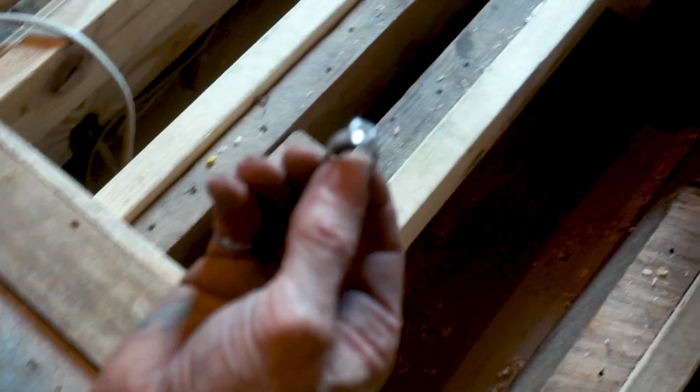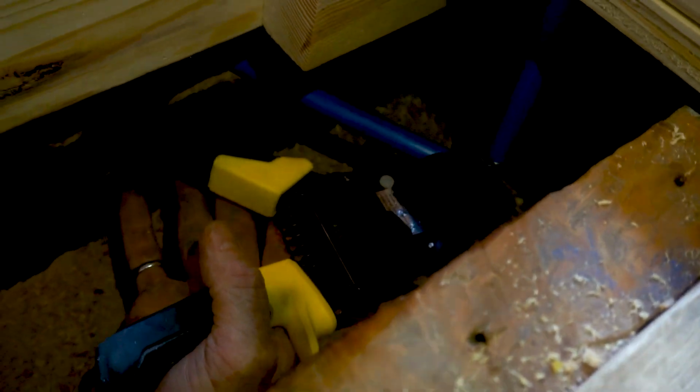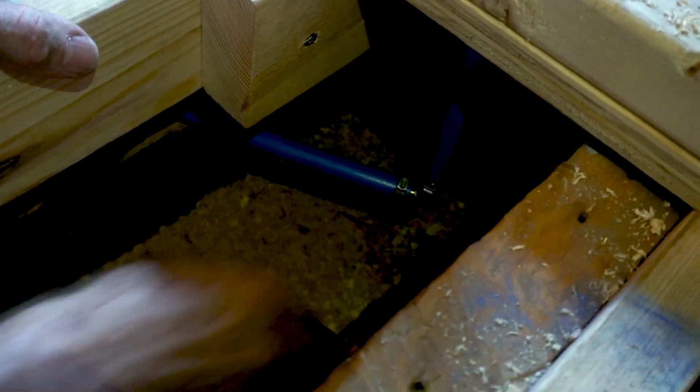The space is too tight for my crimping tool, so I'm using a different type of crimping ring and a smaller crimping tool that I have. In this case, instead of compressing the ring, it pulls the ring tighter by pinching that little metal knob at the top. With this tool, you keep tightening until the blue light goes on.